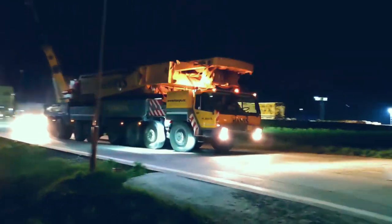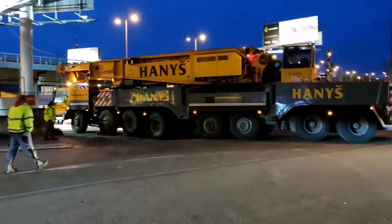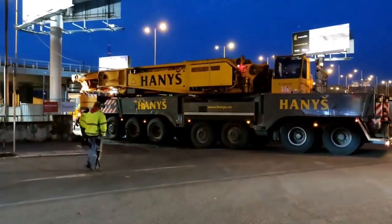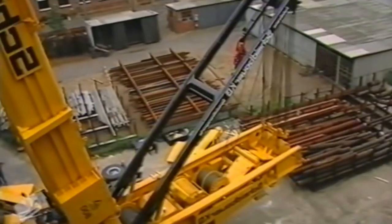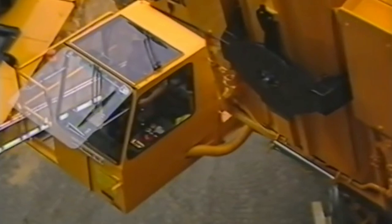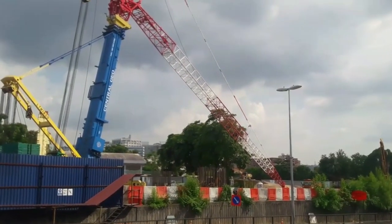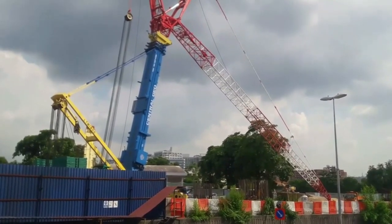The LTM M1800 has a travel speed of 67.5 km per hour, and is powered by an eight-cylinder diesel engine type D9408 TIE, with 420 kW or 570 horsepower. The crane engine is a six-cylinder diesel engine type D9406 TIE, with 300 kW or 408 horsepower.